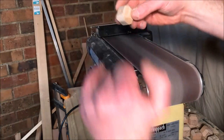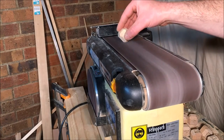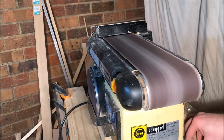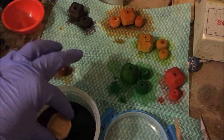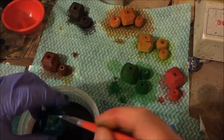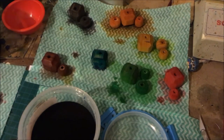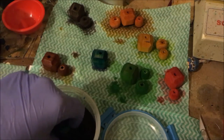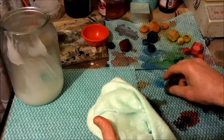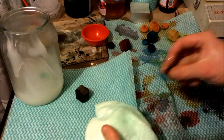I just finish up some of these corners a little bit more, then I finish the beads off by dipping them in a non-toxic water-based dye. Then when that dye has dried out I've got a mixture of beeswax and mineral oil which I use to seal the beads and protect them from moisture damage.